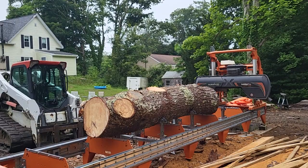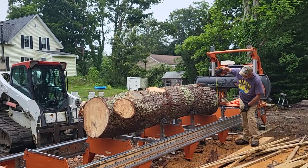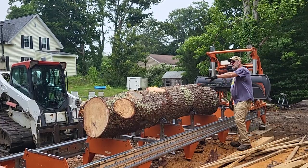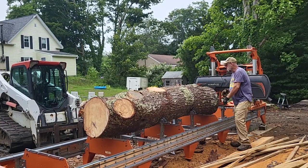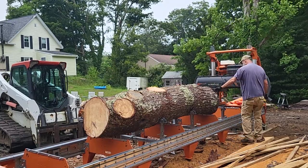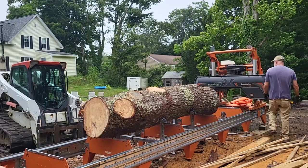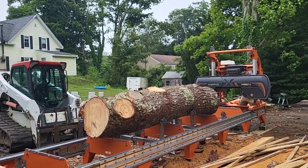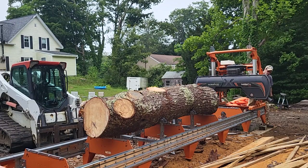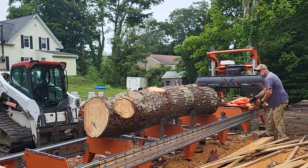My top cut is going to be somewhere around 19 — it might take me a couple of cuts to get it shaved off, but somewhere around 19, and that's going to get most of it cleaned off. Once we get a good flat spot we'll flip it over and mill the rest out, get my four-inch slabs. Turn my water on, turn my mill on, get it warming up, and get the clamp off the mill. Hopefully we'll wear the rust right off the band and hopefully I have no clearance issues.